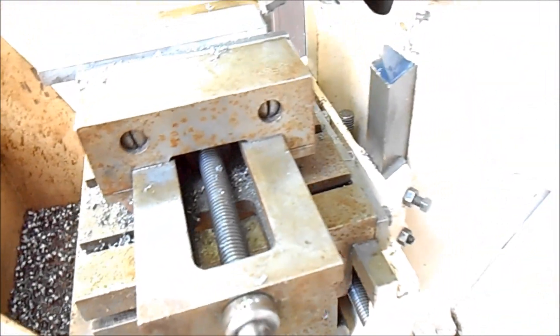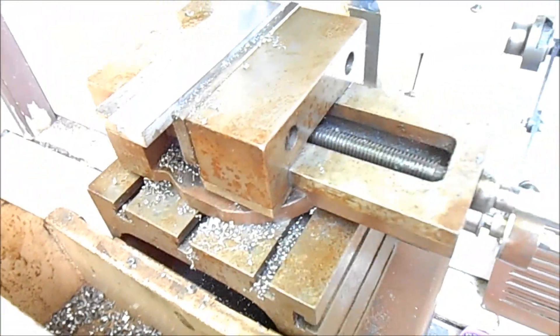We're taking a cut — it's at least an eighth of an inch deep — and we're getting a real nice surface finish on it. You can see a little bit of the tool reflected in the end of it. And even with that deep of a cut, it gives a really nice finish. We're not advancing a great deal between cuts, but the depth of cut and the length of cut is pretty substantial.